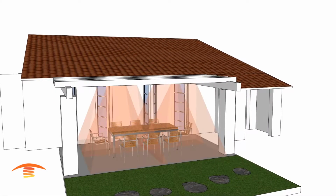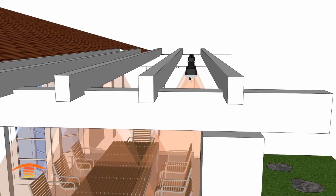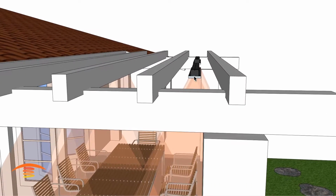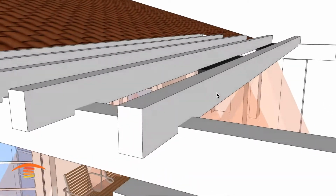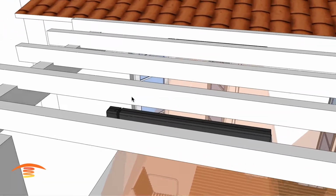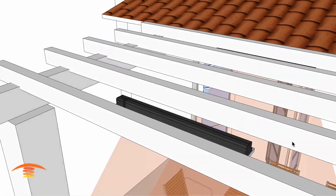And so the final option I came up with that would work would be the Slimline Infratech. This is an SL2424, so a 2,400 watt unit. And again, same elevation as the bottom of the beams here. And you're going to have to come up with your own mounting bracket. I would suggest maybe taking a piece of 1x1 tubular steel, something of that nature, and bringing it across and dropping down a bar and making your own bracket.